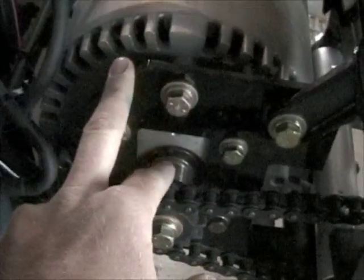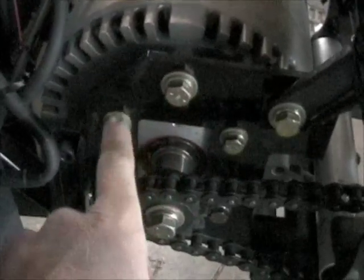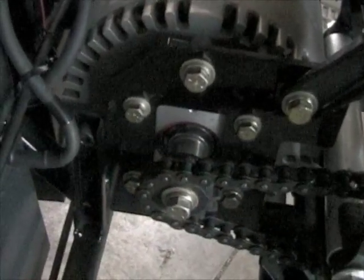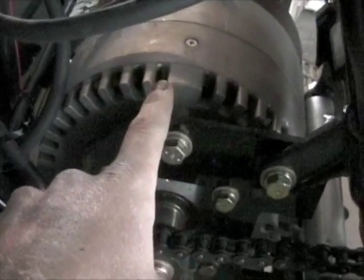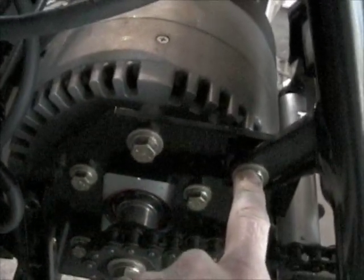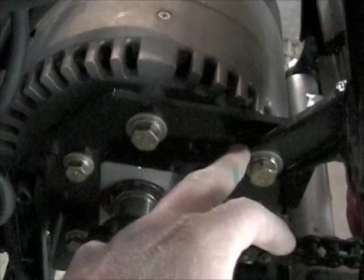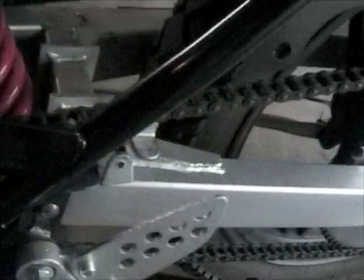Here's the motor mount plate that I had to machine. It was pretty straightforward — I just put in the bolt pattern that was specified in the motor engineering drawing. The motor is essentially cantilevered off of these front connections, and I was able to use the existing engine mounts, which made life a lot easier. I have these little quarter-inch thick spacers here that brought the plane of this gear in line with the plane of the back gear, and it allowed everything to line up very well.